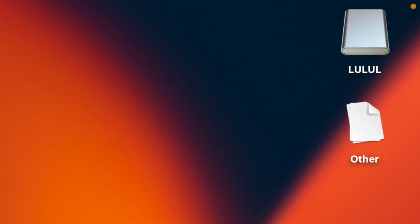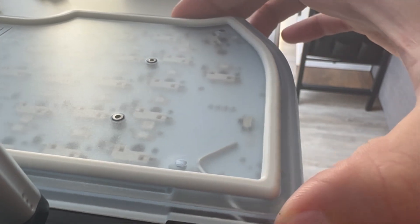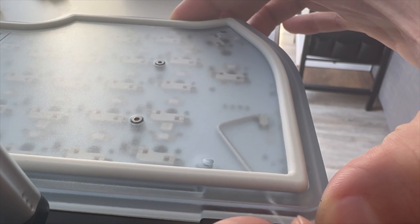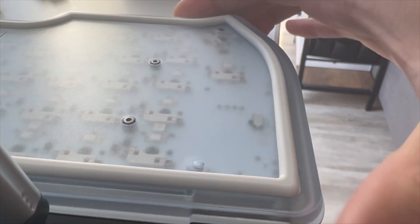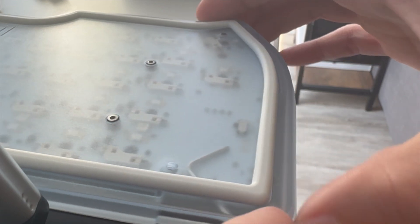We need to boot it so the computer can recognize it and we can configure it. Setting the keyboard in boot mode is very easy — you just need to slide a switch on the back of your PCB. Flip it around and there's a switch you slide until you see the silhouette of the switch on the back. I'm inserting this tool on the back because I built my keyboard before trying to configure it. The back part I could screw in but couldn't screw off. Luckily I could use this tool provided by board source to conveniently slide the switch on and off. Find the same switch on the other keyboard and repeat the same process.